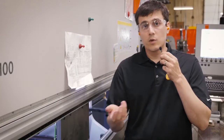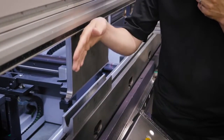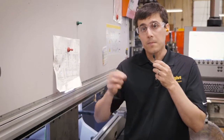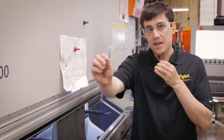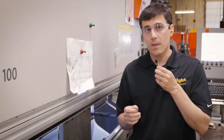Once we've cut the steel, we bend it with brake presses like this. What's going on here is that there's a punch and a die, this V-die. When this punch goes down, it folds the steel. So what we're doing right here is just like making origami. We're bending all the pieces that make up that mower. Now, the more we bend the parts, the stronger the mower is. A bent seam is a lot stronger than a welded seam. So whenever possible, we bend the material, makes the machine as strong as it can be, and also helps that edge look really good on the mower.